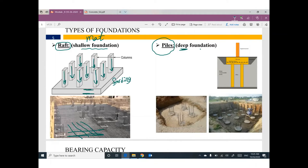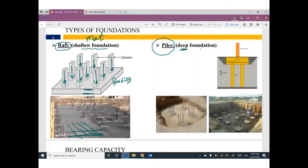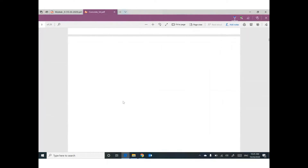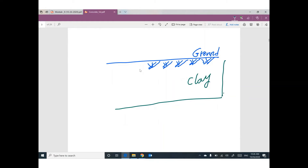What is the main reason behind using piles? Here is the ground surface, and soil investigation told us we have a clay layer for 20 feet, and after the clay layer we have a sand layer for another 30 feet. We are constructing a bridge, and this clay layer is very weak — it cannot support the load from the pier or column.